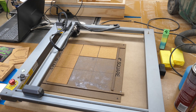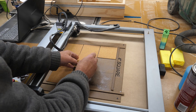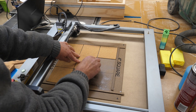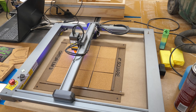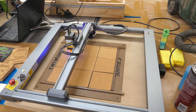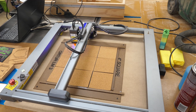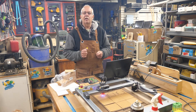These coaster backs are supposed to be four inches square, but that's a nominal number — my squares are exactly four inches but these are not quite. It works out fine for the design. The problem I was having was that as the laser got to the edge of the coaster it would lift up the one next to it, or lift up the one being engraved and blow it to the side. The spray adhesive is stopping that from happening.